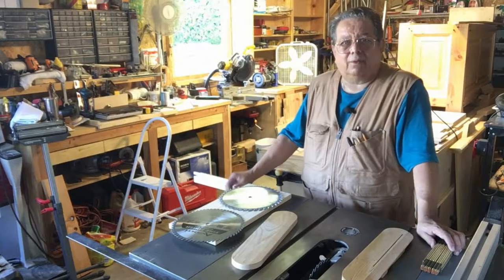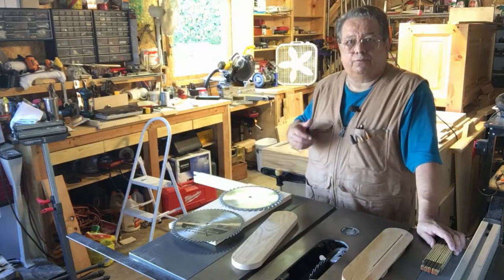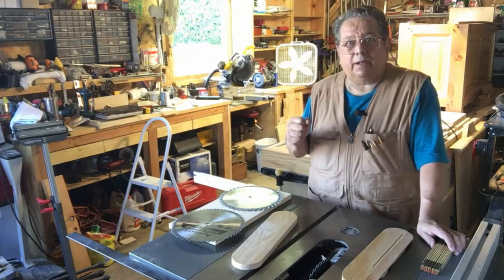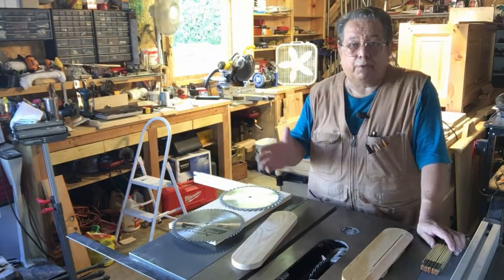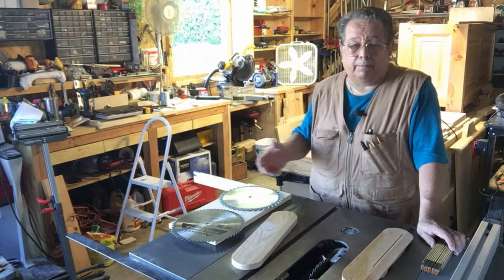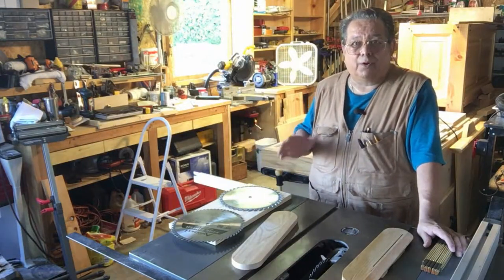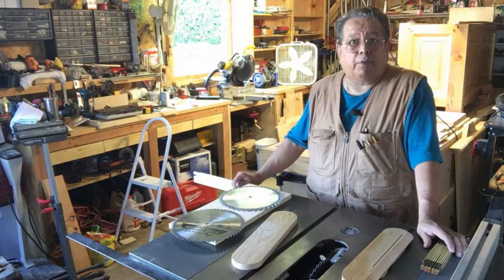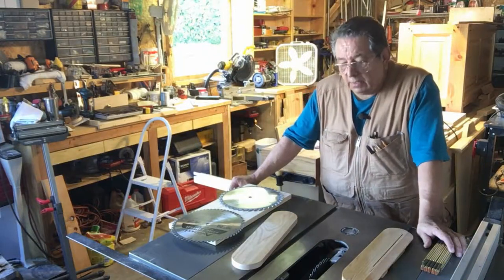And cut. Don't go slow, like some of the guys do. Feeds and speeds. Feel your cutter as it's biting. It'll tell you if it's going too hard or too slow, because going too slow is no good either. You burn the bit, you burn the billet, you burn your material up. So learn your feeds and speeds on all your material. Plywood cuts different than hardwood or pine. It's all different.